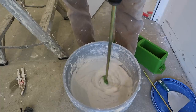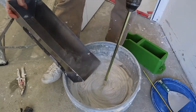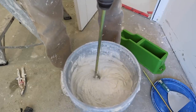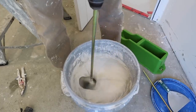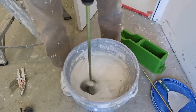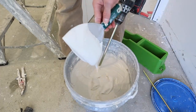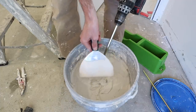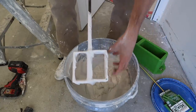You're going to want to get all the bubbles out and add a little bit of water to it. That's fairly thin — it's running off the knife and should be thin enough to lay the tape with. Think of something like yogurt. Because this is plastic, it's not going to scrape the sides of your bucket and put little shreds of plastic in there.